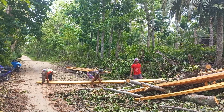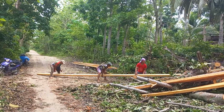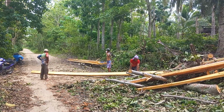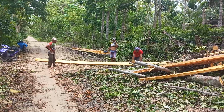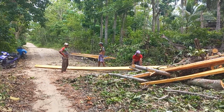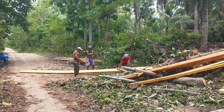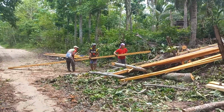Now, the secondary thing that you've got to consider here is that, yes, it's bouncing around like that, but also the wood is soaking wet. It was only felled 2 days ago, and it stiffens up. It becomes harder and stiffer as it dries. So we hope that this will be okay, and we're not going to be walking around on a floor that's going to be boing, boing, boing, jumping up and down.